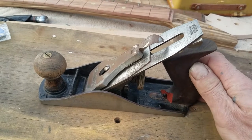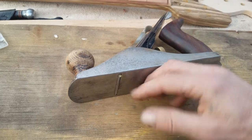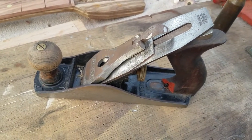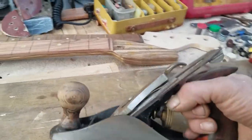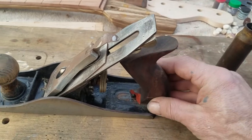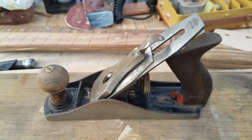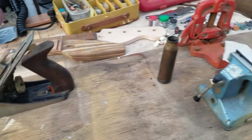I don't recall where I got this — perhaps at a garage sale. I really love it. It's a Stanley Bailey number four plane. In case you don't know woodworking, a hand plane is very simple — it has a blade that comes out the bottom at an angle, you can adjust it for depth, and you just push it along and it cuts up pieces off the top and flattens your surface. A lot of woodworkers still use a standard plane — they are amazing tools. When I restored this I only got partially done, but I got the blade all sharpened. The handle was totally busted, so I made a new one out of a piece of padauk, which is a reddish wood. I've been using it so much — it's dark now — but the corner broke off down here. It's a restoration project that after a decade of use finally broke and I need a new one. The types of wood you choose for restoring things is important too.